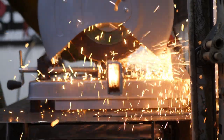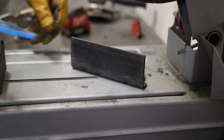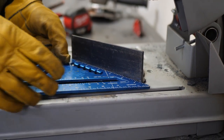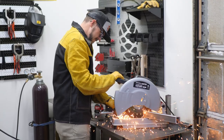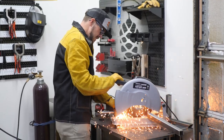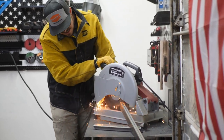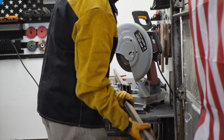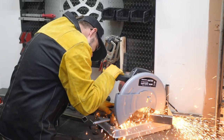You're going to have to miter these corners, because you don't want any open gaps on any of them, even if it's to the ground. It's pretty simple to just miter each side. The bottom piece will have two miters, the sides will have one miter, and the top of the side supports of the U-shape leg will actually be flat. We're going to weld a flat bar on top of that flat piece, so you don't need it mitered on top. I adjusted the fence to 45 degrees and cut the miter right on the marks at 16 inches.